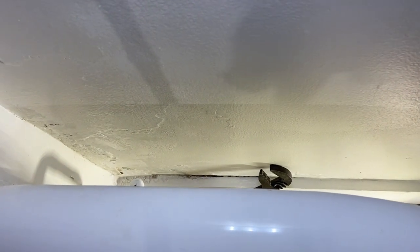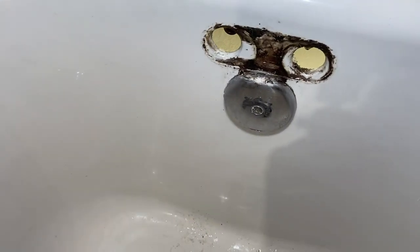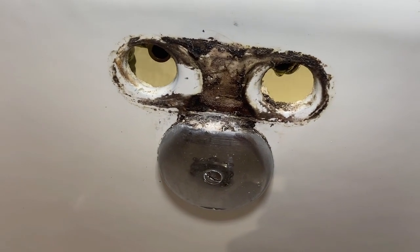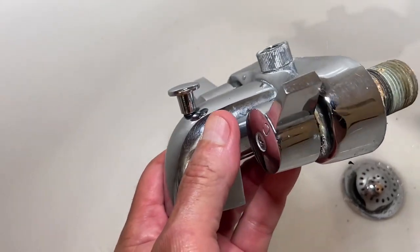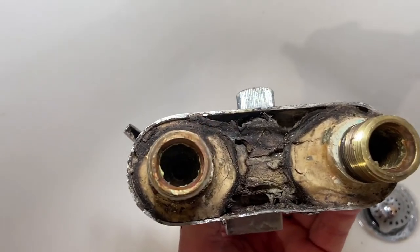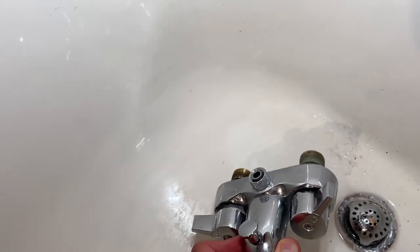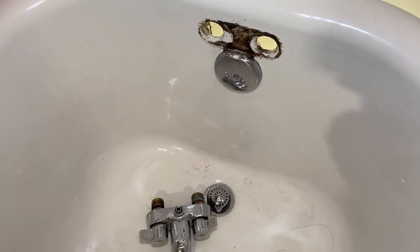I really almost was going to remove the overflow to try to aid in getting at the hot water side, but I couldn't get the screw out of that overflow plate. So I hacked at it and eventually got everything off with my channel lock pliers — I will say it was a bitch. Here's the old unit once I got it out. You can see what it looks like from behind. Generally I packed them with putty because they're hollow-bodied, and I packed them so that when I installed them the putty can squeeze out.